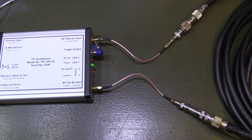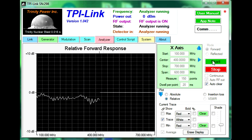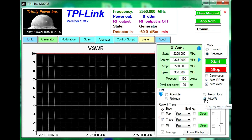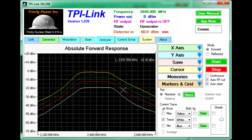Here's a typical setup for testing a piece of unknown coax — just using little jumpers and adapters going from the SMAs to the coax. You set your frequency range, hit start for a scan, it scans across the frequencies, and when you put your cursor over the scan you can see the exact loss at any given frequency. You can do the same thing checking antenna resonance — looking at VSWR, your cursor showing SWR at any given frequency. And here are multiple scans on screen at the same time, so if you change something about the antenna or bandpass filter, rescan it and see the traces side by side as you dial it in.